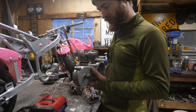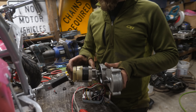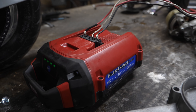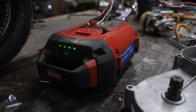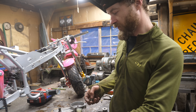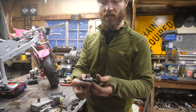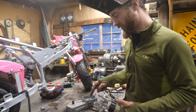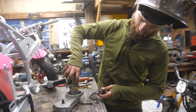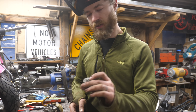Now I'm figuring out how to get this reduction adapted to this. I've got a plan to adapt this motor to this gearbox. Basically I'm going to take these two sleeves that have flat sides on them, weld them together so it's longer, and use that as a coupler from this shaft to that one — which I've ground down to be flat on two sides as well. This little piece here will be the coupler, with this bolt to hold them aligned while I weld them.